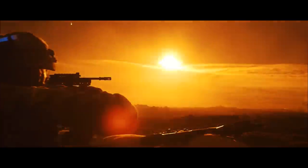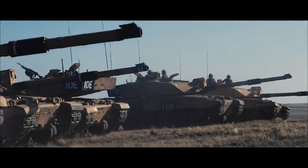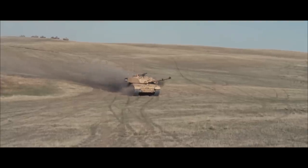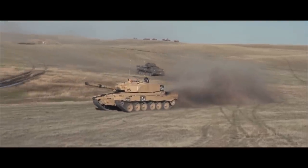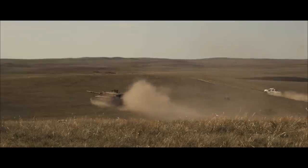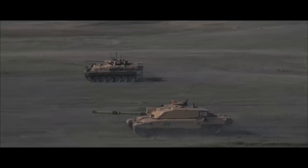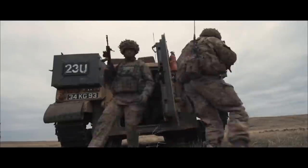The new control panels have some of the latest hand controllers, intelligent flat panel displays, giving a more modern feel to the vehicle, with other major improvements based on the defense of the system from any kind of anti-tank weapon system. They are going to improve survivability measures with better hit probability, faster targeting, and vastly improved sighting systems. Some of the sighting systems placed on the Challenger 2 now are to allow it to be more hunter-killer capable. It hasn't been great at night, with concerns about clarity and visibility during rough conditions, so they're trying to increase what you see through the sight — imperative when engaging targets up to two to three kilometers away. They're going to use an open architecture approach, meaning future upgrades will be incorporated much more easily, with cross-compatibility between parts, components, and other systems.